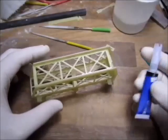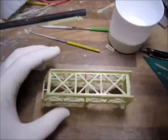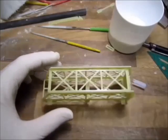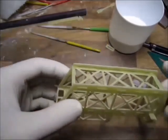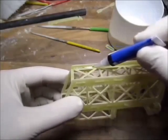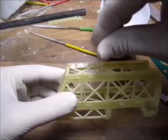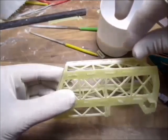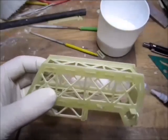And here's my very favorite trick in the copter builds that I build. I'm using basically a super glue and baking soda. One of the comments on YouTube early on gave me that tip, and since I discovered the use of it, it's bloody brilliant. When the parts interlock in each other, you can do a little bead around. So getting a bead of glue in there, and sprinkle some soda. There it is. Dries instantly.